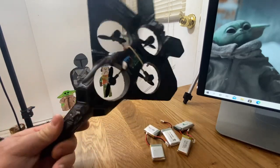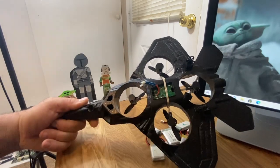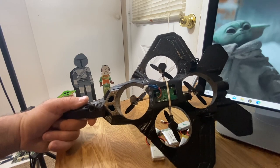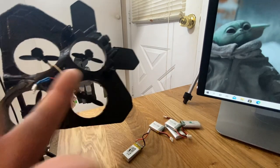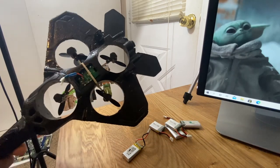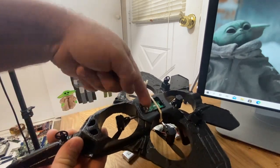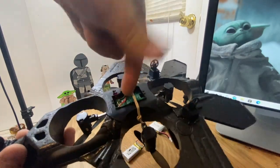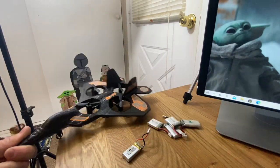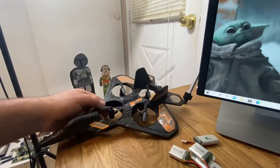It's not hard guys. Just cutting and removing — take your time with the X-Acto knife however you want to do it. The Dremel is tricky — just be careful. If you cut the battery it's not the end of the world as long as you don't damage the board, but you don't want to get any of the acid on you. You could theoretically even twist and connect the wires with some heat shrink without soldering since the wires were about that long, but it was too short for me with my fat little stubby hands, so I went ahead with the solder.